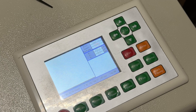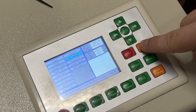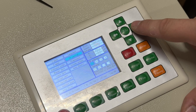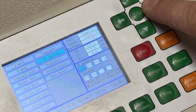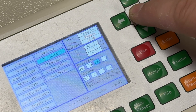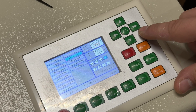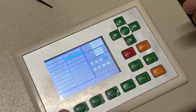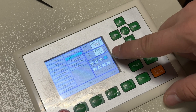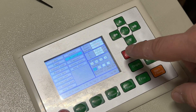Once you have the IP from your computer, come to your laser that's plugged in and hit your ZU button, navigate all the way down to ipconfig, and hit enter. Now you're going to go through and change these settings — I'm not going to actually change any here since these are the settings I used, but you'll hit the ZU button to go between fields. Here's the one thing to remember: do not enter the actual IP address that you saw on your computer. Enter typically just one number off — on my computer it was .39, so I entered .40 on the laser. Then jump down to your gateway and make sure those settings are all the same.